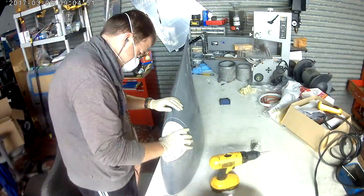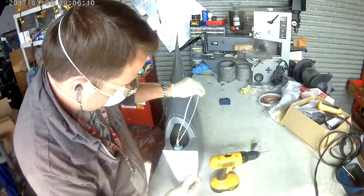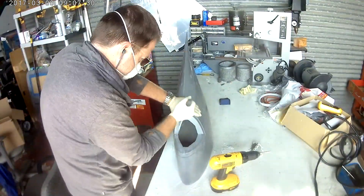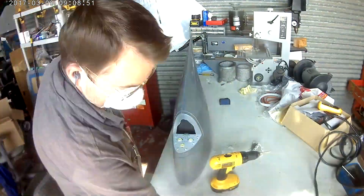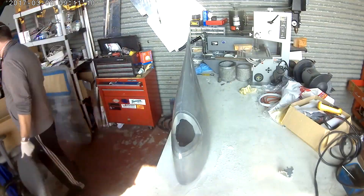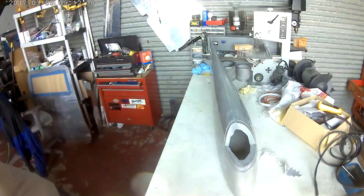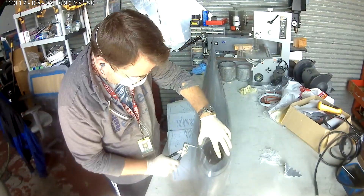Once the hole is set and we're happy with it, we can go ahead and put the lens back on top — the nice plexiglass lens that we worked on several videos ago. We will be drilling the test pilot hole for both sides of the tip using our special number 40 bit that we created by putting it into the drill and running that bit while holding it up to the edge of the bench grinder to make a nice 60-degree tip.